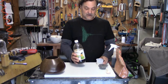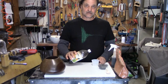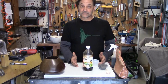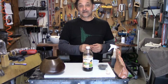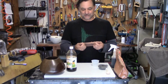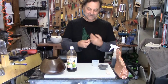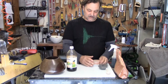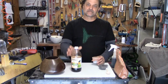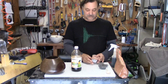Once that's done, what I like to do is I will take the bottle and I will strain it, filter it through either a coffee filter, or what I've found that works really well is at a shoe store, those little booties that if you don't have socks, they're like nylons, you can just stick that over the bottle and pour it in to strain out all of the steel filings that are still at the bottom.